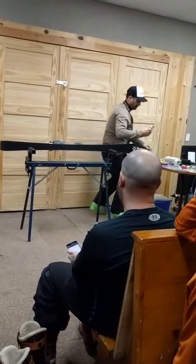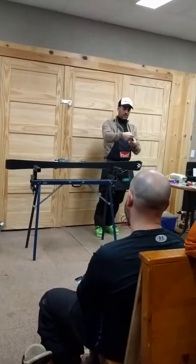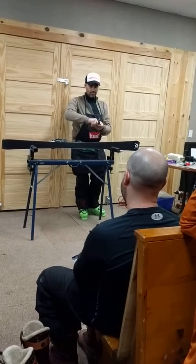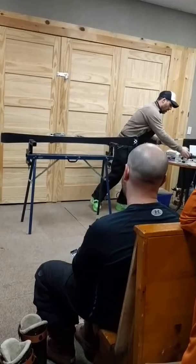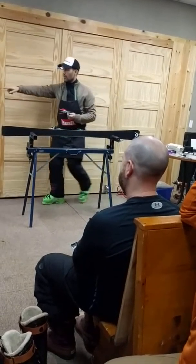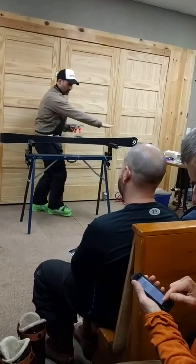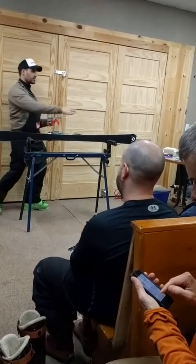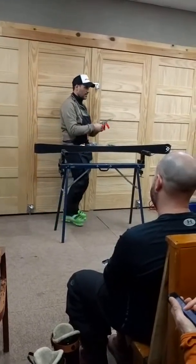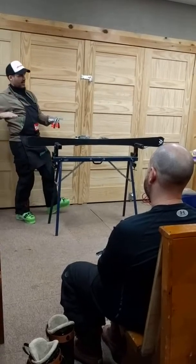All right. So basic kit. So there's two types of kits. This is the normal set. You get a file, you get a file guide, and you get a clamp. I always use two clamps, because if the file moves, what happens to your angle? It changes. It gets ugly. And we want a perfect angle. How many degrees, Mia, do we want? 88. All right, so that's like 2 degrees, right? And we don't want it to go 88, 89, 87, 88, or 91, 88, right?